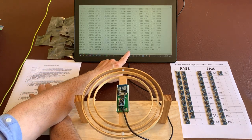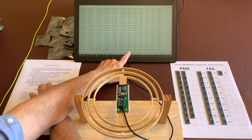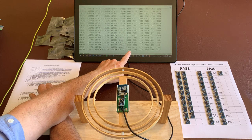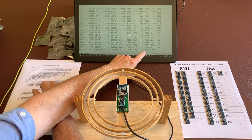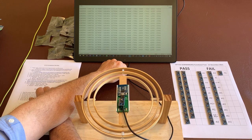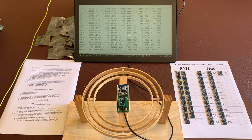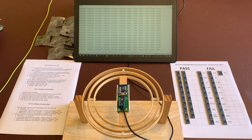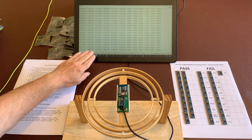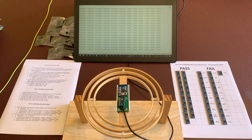The values extend in both directions so the offset is more or less in the centre. The same here for the gravitational axis. This is the magnetic axis — you'll notice the numbers are smaller because the magnetic sensor is not quite as sensitive. The magnetic field of the Earth is not quite as strong as the gravitational field: 600 / minus 700, 400 / nearly minus 800. But look at this: 255 / minus 256. That's about half the range we're looking for, and there's something peculiar about those numbers. 255, 256 — that looks to me to be an error in the communication of the data. So the way we record that failure: it's a failure of the magnetic Z axis.